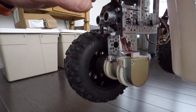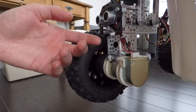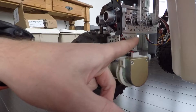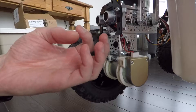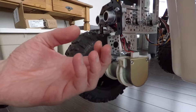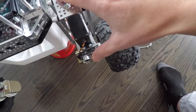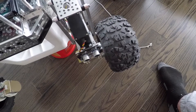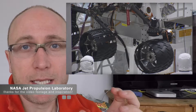So we can tackle something fun today. Right now the servos are really just mounted and wired up, but there's no programming and they don't have any function as part of Rover's drive programming. In taking that step forward, what we need to do is disconnect these two and put in some mechanics to allow rotation. That actually creates a problem with how I've designed Rover. I positioned the wheels outside of his main chassis and not directly below the servos — it was a look I wanted, aesthetics — and I didn't appreciate the complexity that it would introduce in Rover's turning mechanisms. With the Mars Rover design, you can see that the tires are directly below the servos that turn the wheels.